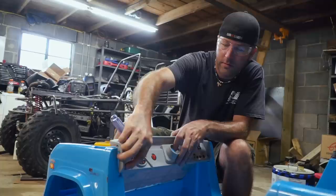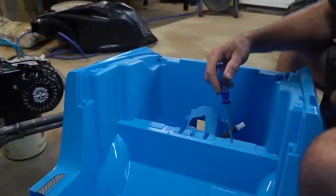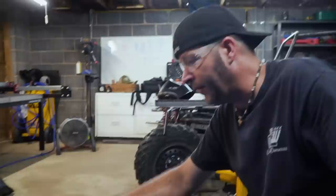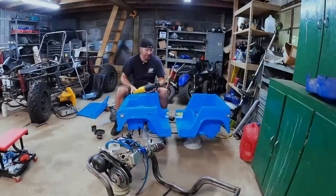I can just unplug the whole thing right here. Easy peasy. I'm going to cut along here, up here and around here, and just kind of get rid of this whole piece. Then we can see the frame when it's in there and we can weld in cross braces for the engine plate. There's our engine plate and it's massive. Yeah, they beefed those things up since last time I checked. You're not going to crack one of those. We can trim it down a little bit.